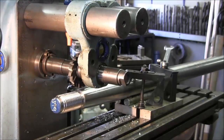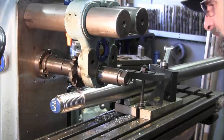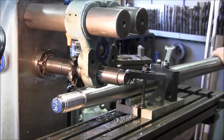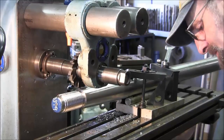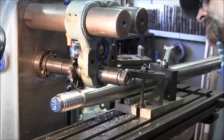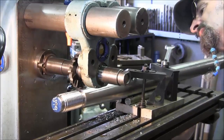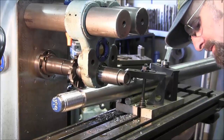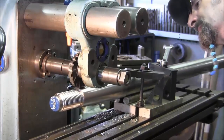We've got this set up and I've got to work the gantry and the mill table at the same time to have stress-free travel. First we're going to establish zero on height and centering side-to-side with a touch-off cut. I get the light down here so I can see from the back side. I set my dial to zero, crank the table back and forth, and when the table gets tight I know where I'm at. I count my clicks on the chain fall because I know how much that brings me up and stress-frees the table.